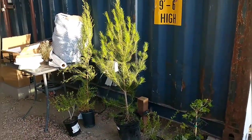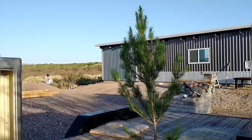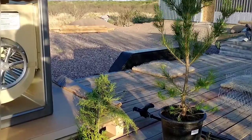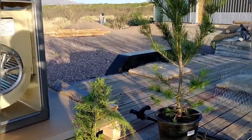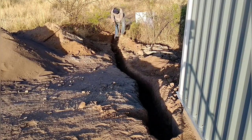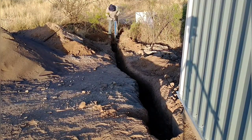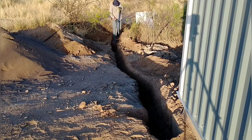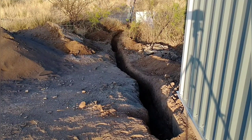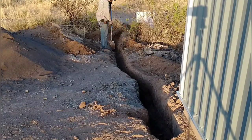Along with the garden, we've been wanting to plant trees and shrubs. In the background you can see me working on the trench for the gutters. I wanted the gutters to run into an underground drain to take water away from the house — running about 20 to 30 feet away. The elevation drops off on this side pretty rapidly, leaving a nice low spot where we'll take the water to help irrigate some fruit trees we want to plant there.